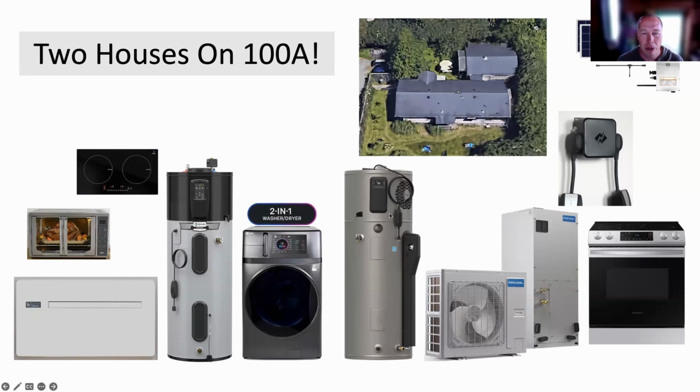And then in the bigger house, this is a Rheem, one of our sponsors today. Actually, well, A.O. Smith and Rheem, they both donated to this project. So they donated their 40-gallon, 120-volt heat pump water heater that we can store at 140 Fahrenheit, has internal mixing valves, just like the A.O. Smith. So that takes care of the big house, and we were using the 40-gallon Rheem because we had to fit into the existing small closet in the manufactured house.